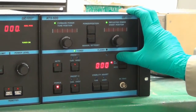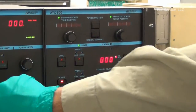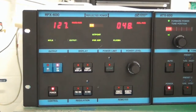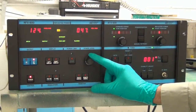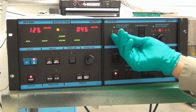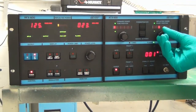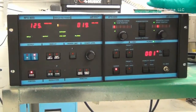There is a push button here to select DC bias or noise display. First, I'll turn on the RF power. You can notice that the forward power is about 125 watts and the reflector is 47. By adjusting the tune capacitor, I'm able to reduce the reflector power all the way down to 19 watts.